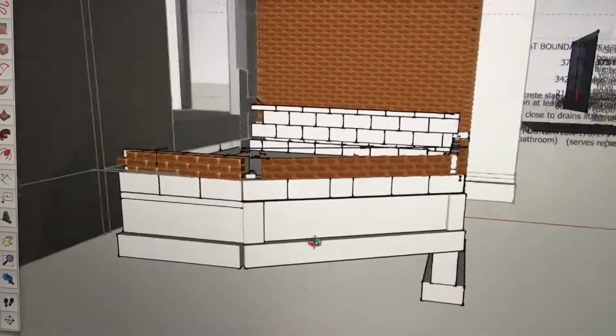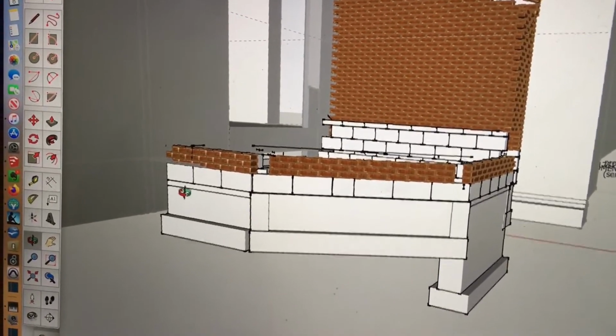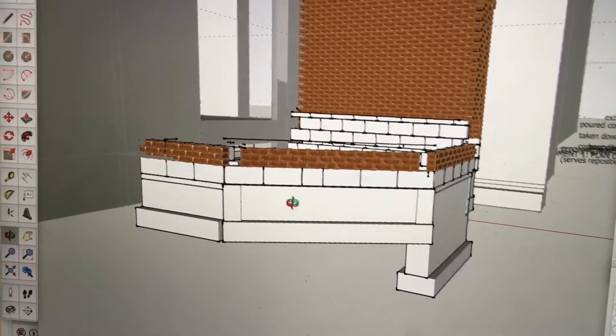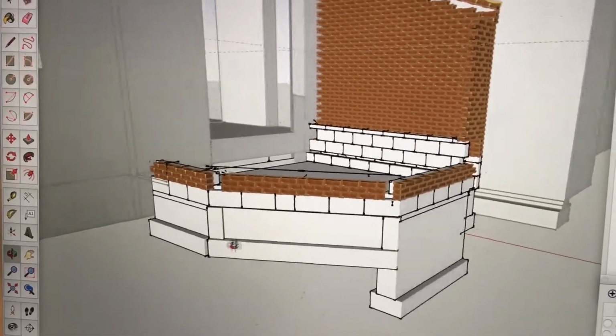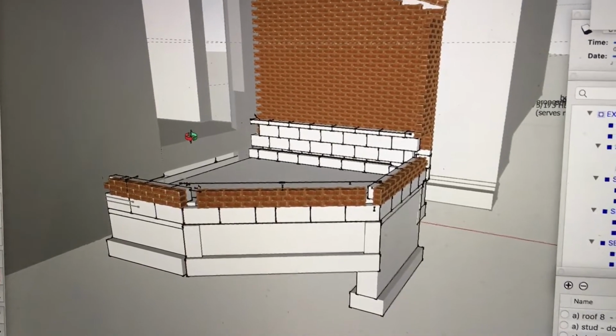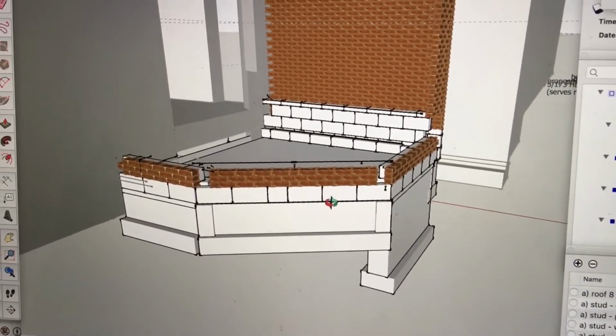And finally, I need to define my horizontals. The top of the poured concrete foundations is rough and deviates quite a bit, and I need to set up accurate levels with respect to the existing floor of the house so that I can hit the mark when I come up through those courses of blocks and bricks.